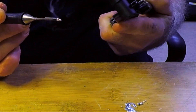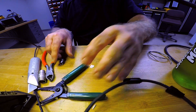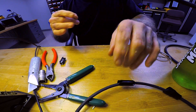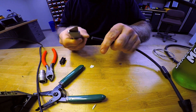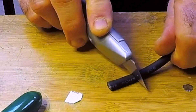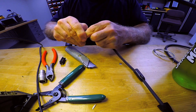You don't want to overheat any of this stuff. The connector and the insulation on the wires are plastic and will melt if you heat them too much. Give it just as little heat as possible to properly melt everything. Use a nice sharp razor blade — you can get a fancy stripper if you want, but this works just as well. Strip about a little less than an inch. Gently push down and roll it; don't press too hard or you'll cut the strands, and you want all of them.